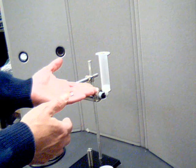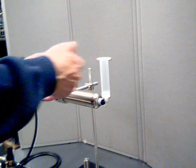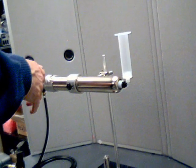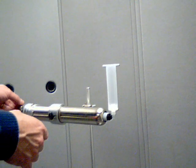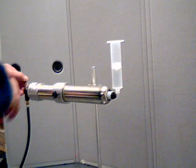As I inject this material into the syringe it'll push the piston back. I've got a gauge tool here with a line on it that I can install into the syringe and it'll tell me when I'm at the correct location and the syringe is full. At this point I'm going to dispense into the syringe now. You may need a slight air pressure adjustment here just to make sure you've got enough pressure to push the piston back.